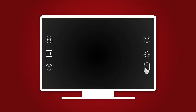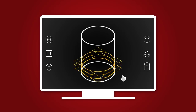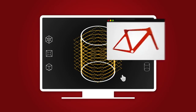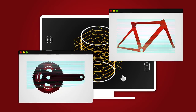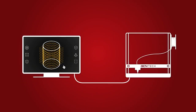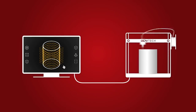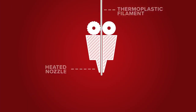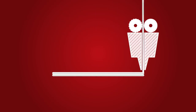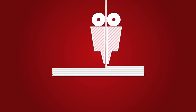These use a thermoplastic to 3D print objects. Before the printing process begins, the user — so you or I — has to slice up that computer design into multiple layers using special software, often hundreds if not thousands of layers for larger designs. That sliced-up model data then goes through to the 3D printer, which builds the object layer by layer from bottom to top. It does this by extruding a thermoplastic filament through a heated nozzle and onto the base of the 3D printer. As the printer builds up these layers one on top of another, the 3D part starts to take shape.